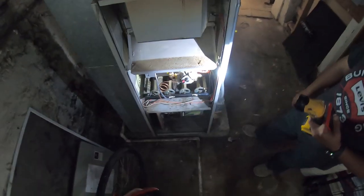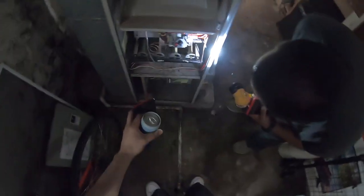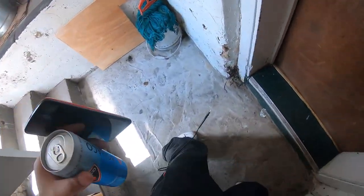Is this the way? Or the board might not be sending the signal, man. It's one of the two, but the issue is within that wire and the signal. Let me get my tester and test the voltage coming out to make sure that it's even pumping anything out before we go on a wild goose chase. Oh wait, I got it in my pocket. Okay. For that one, I think it's C and Y. So I'm gonna test the C and the Y here.